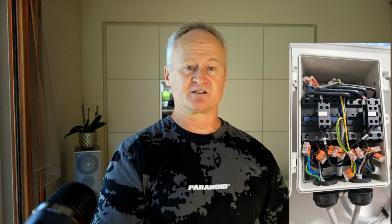The total 5 kilowatt then flow through the contactor, entering from below and exiting from above, and continue together to our consumers. As explained, the electricity from the public grid bypasses the inverter; it meets, as mentioned, outside the inverter with the electricity from the inverter. When the contactor detects voltage at its lower end, it allows current to pass through. This is known as pulling in.